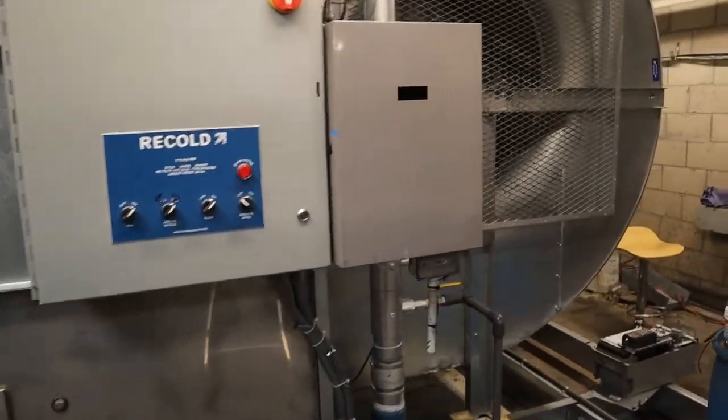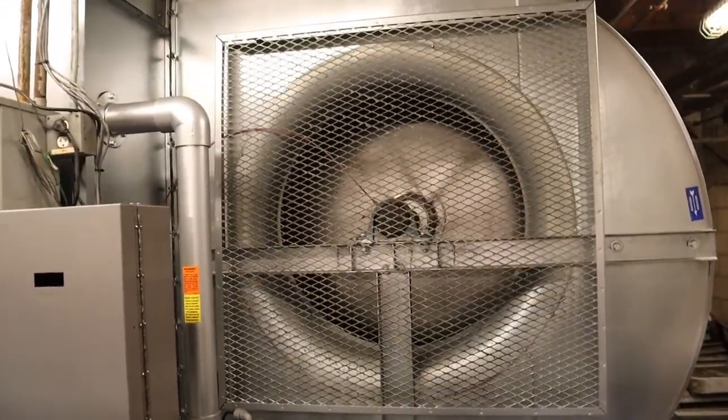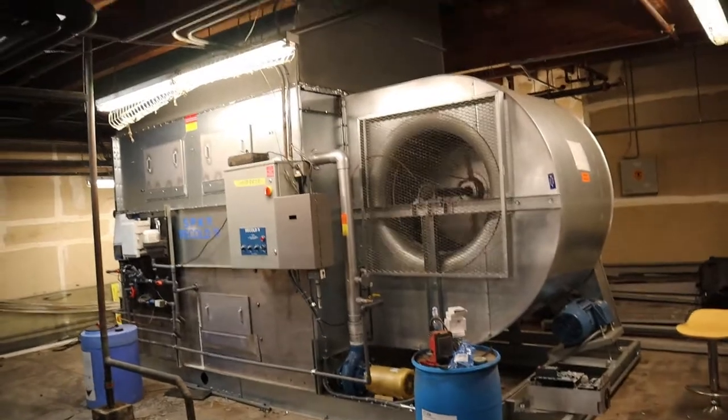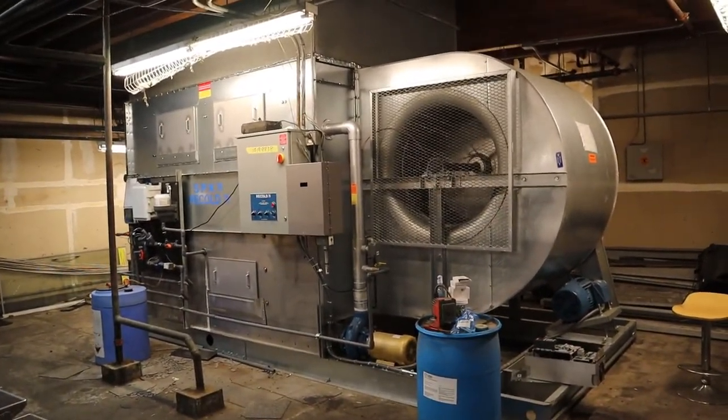A lot of the people in the supermarkets get stuck in this level of drive programming, wiring, but it's good stuff though. But I just wanted to show some of the basics in the video, what to check, run enable, speed reference. So when you're troubleshooting, go to a store, just give you some basics what to look for.